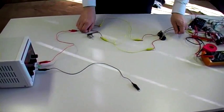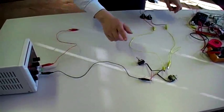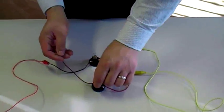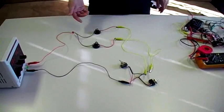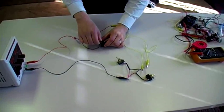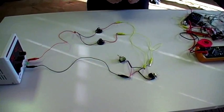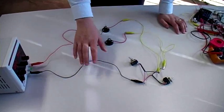The way I've connected this is actually incorrect. If the negative is representing the active wire in an AC circuit, then we actually need to put the switches on the active side. So we turn the whole thing around, and that'll be correct. The reason is safety: in actual household circuits, the switches always come before the light bulb. If the switch is turned off, everything behind the switch does not have a live voltage attached to it. For example, if someone is changing a light bulb while the switches are off and touches some metal, they won't be electrocuted because the switch stops the voltage beyond that point.